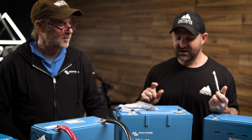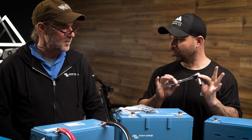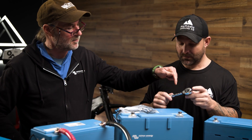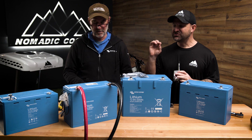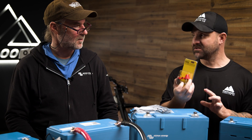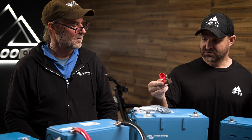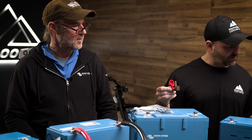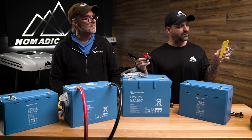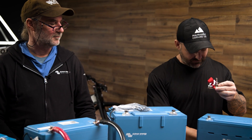If you're working in tight spaces, do you ever use an insulated wrench set? Sure, or use some electrical tape. At Nomadic Cooling, we do not sell a battery for any sort of electrical kit if it does not come with a terminal fuse. We use this Blue Sea terminal fuse block — it's rated 30 amp to 300 amps DC, called an MRBF.